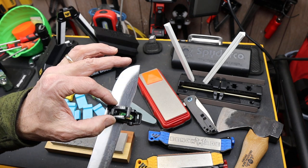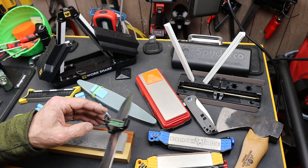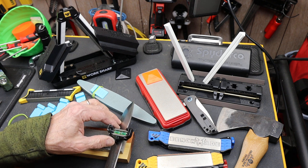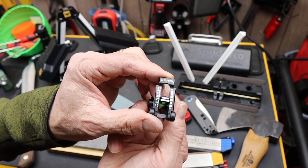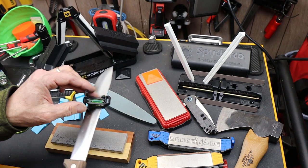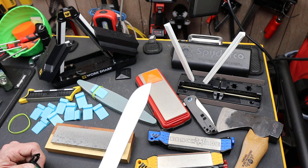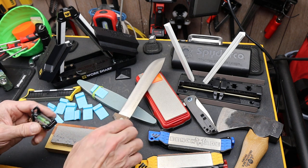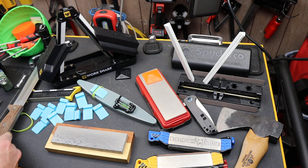It's a pretty sweet little engagement tool once you get it down, especially for steeper angles — look at how steep that is, you're talking woodworking tools, splitting mauls, or similar. As for accuracy — well, the graduations are fairly big jumps, so you're making a reasonable estimate, but it gives you a really good idea as to where you are. That's the critical part of sharpening. You can sharpen on a piece of cement or a river rock if you can get the angle right — it's knowing what that angle is and maintaining it consistently as you hold the blade.